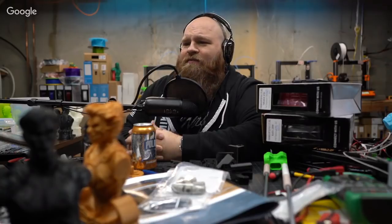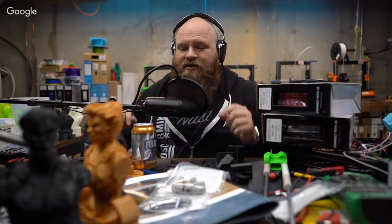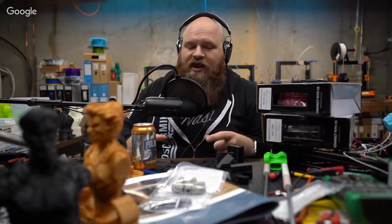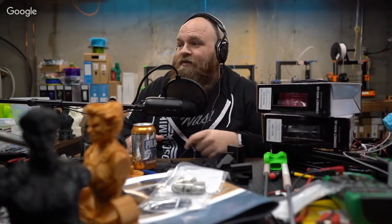Yeah, just in 3D. I've had it where it won't XYZ calibrate, and usually that means a length is off somewhere. Now on the Bear, if you assemble the length of the vertical frame wrong, because there should be, I believe it's 106 millimeters from the back. You should have that vertical Z frame installed. If that's not correct, it might mess up.